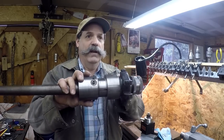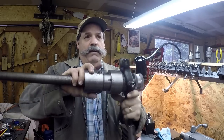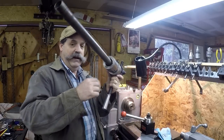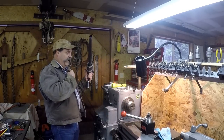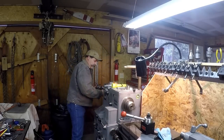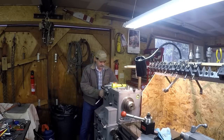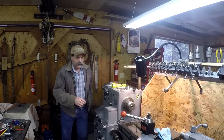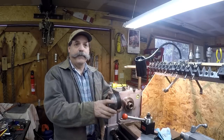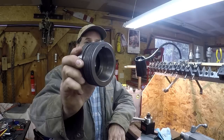The handle is attached to the actual housing on the lathe through a little leverage arm, and it just spins. I'm going to slip that in the back here. Okay, so that's back in the spindle. We have a few other parts — this here goes over the nose of the spindle. The spindle mount is an L double zero.